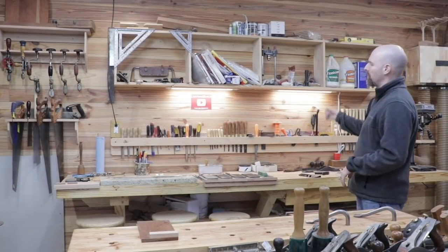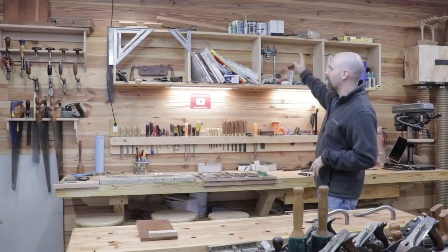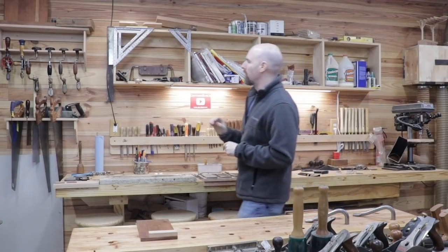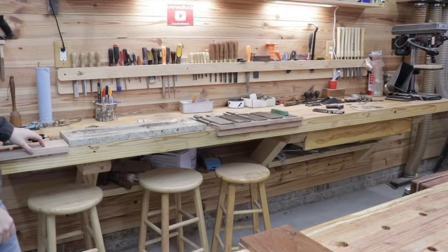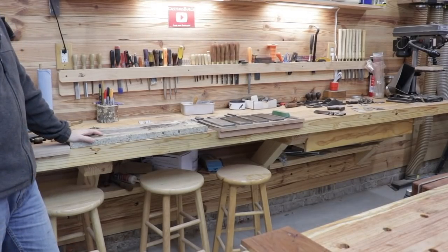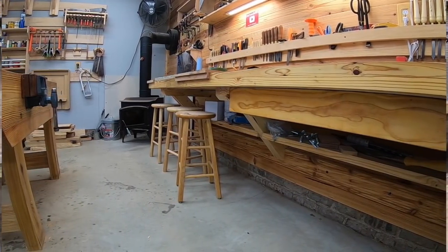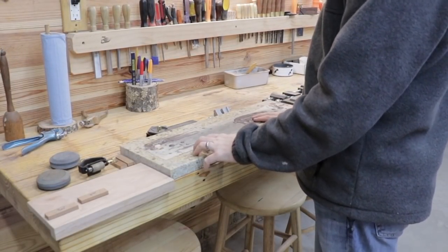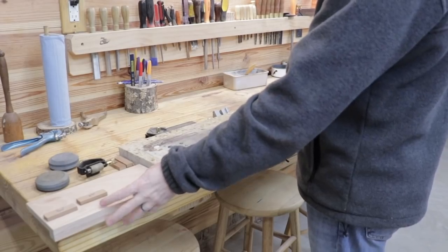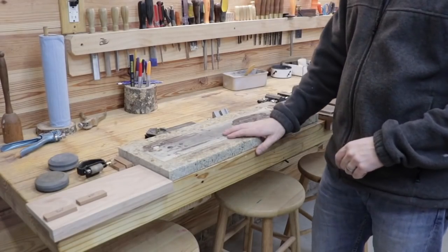The south wall holds most of my chisels and screwdrivers and also my lathe tools, and then I have this shelving here for glue and various items. I also built this custom rack for saws and my brace and bits. This workbench was actually the first that I built for the shop — it's a workbench attached to the wall, three feet in width and two inches in thickness, made of laminated two by eights. I use the left corner of the wall-mounted bench for my sharpening area. I have a workflow here for sharpening my chisels and plane irons, and I actually made a video of that and I'll put a link to that above.